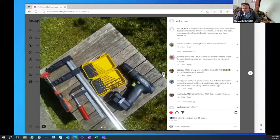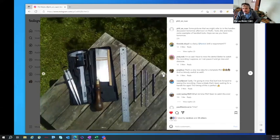If we could go to the next slide. A vernier caliper, a measuring caliper, is a really handy thing to have around the shop anyway as a spoon maker. I find it particularly useful because although makers claim that they've got a fixed and standard size tang, most of them vary a bit, so it's worth measuring. So you know exactly where you are. And it also gives you a guide of what size drill holes you need to take. I find a pair of dividers, some people call them calipers, really helpful in setting out to get center lines, etc.